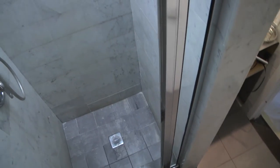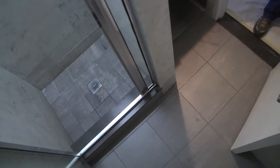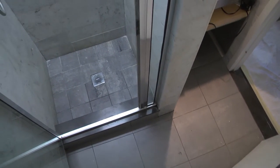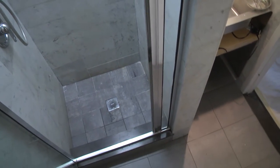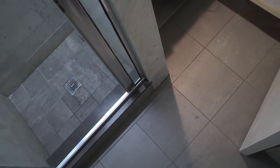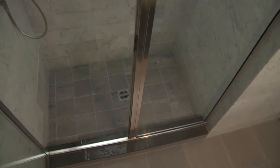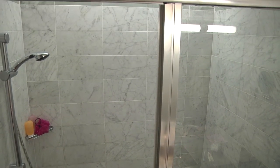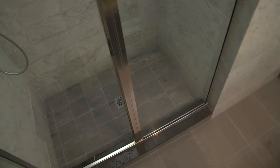This is a room where we'll be staining the grout outside and inside the shower stall — this is a before picture. The grout is dirty and uneven in color. Applying our nanotechnology stain will make it even and uniform in color and stain-proof for years to come. This is the completed room with a shower stall: we've re-grouted inside the walls, caulked up the verticals, and stained the grout inside the shower stall and outside on the main bathroom floor.